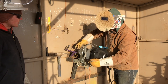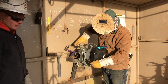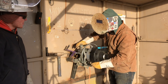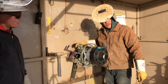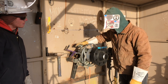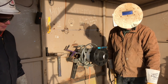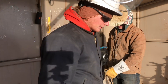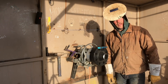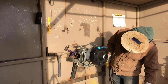This is just as good. When you run stainless and stuff though — for anybody that doesn't know, stainless is not magnetic. So you have to run two-hole pins or else you'll go crazy trying to hold this on here. Always level your flange — don't level the front of this, because this is what needs to be leveled. You're gonna have to take the gap whatever it is, but these are all factory bevels, so they should be pretty close.